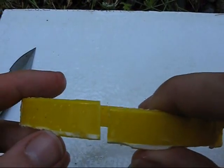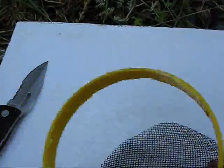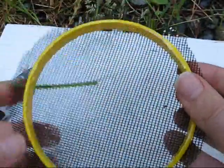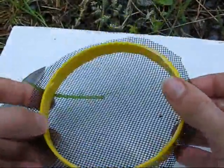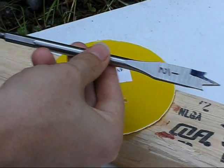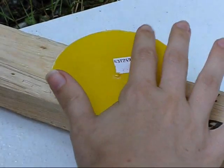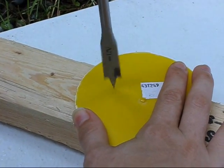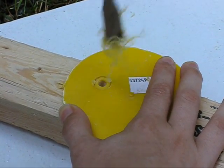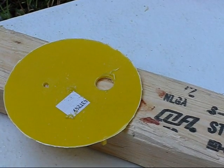To shrink the ring and make room for the plastic screen, cut a millimeter or two of plastic out of the ring with scissors. Place the ring on the screen and cut around it, allowing an extra half inch of screen beyond the edge of the ring. When drilling holes in the test plugs, you don't have to drill all the way through. If you have a drill bit like this one, place the plastic on a piece of wood, drill into the plastic, then pop the plastic out. Any burrs or uneven edges will have to be smoothed by gently rubbing the inside of the drilled hole with the edge of a blade.